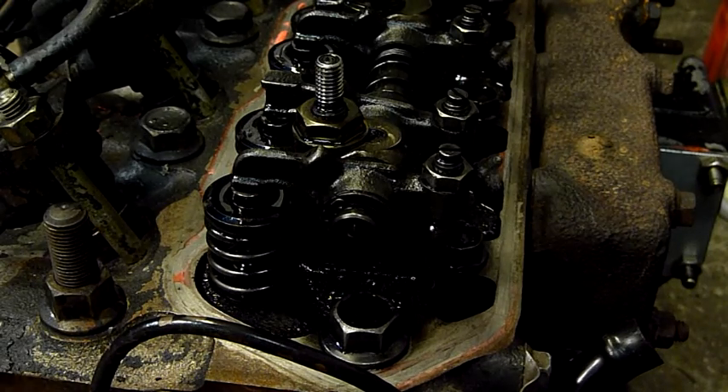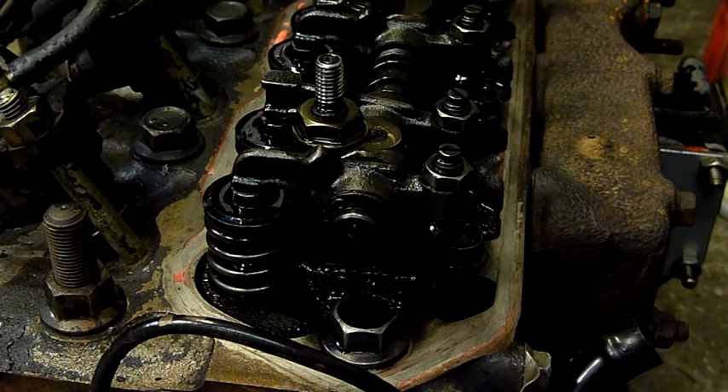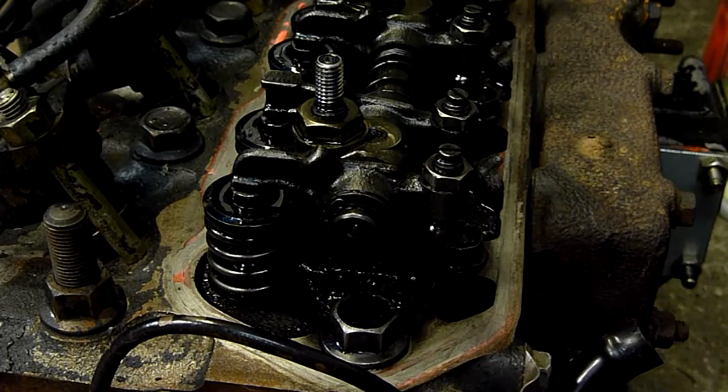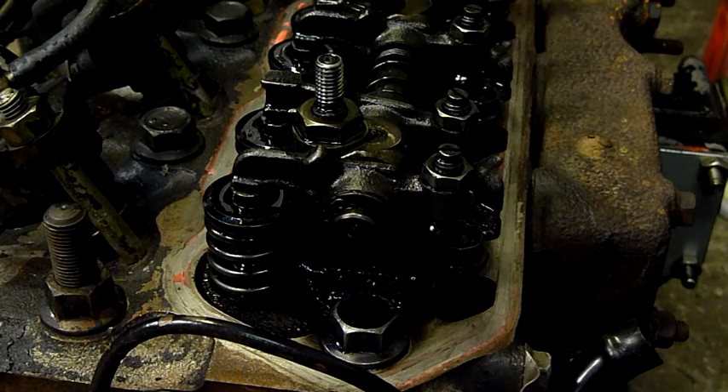It's also a good time to do an oil change — I've done that already on this one. Use some good high quality diesel engine oil. I can't remember the exact grade — I bought it bulk from the distributor. Just anything for stationary or tractor engines, multi-grade. Depends on your climate: if you're running it in sub-zero conditions you need a thinner oil; if you're running it in really hot conditions you need a heavier oil.